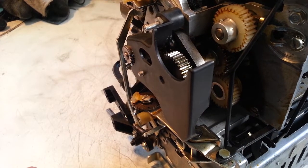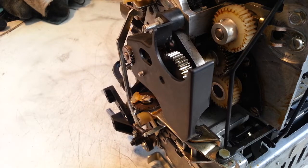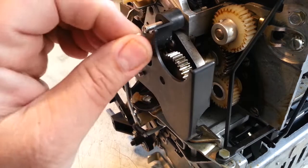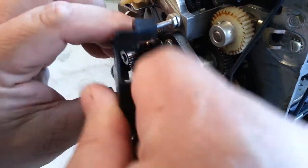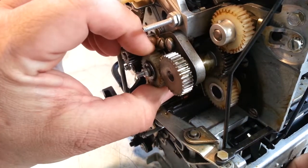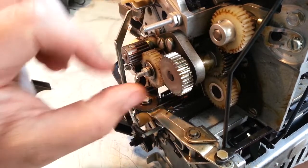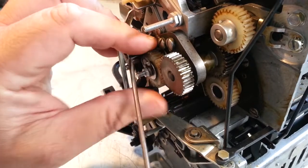We're going to take off this cover and take off the gear, I think it is, and see. That's what I thought it would be. There's a bushing in this gear pack. I don't think it's this gear pack. I think it's this intermediate idle gear right here. No, it's moving. Now I think it's the carrier shaft, and the whole carrier is jammed up, because that shouldn't wiggle, and it does. I'm going to take it off anyhow.